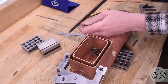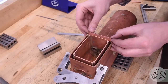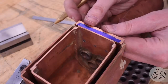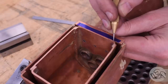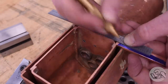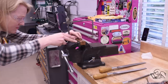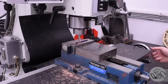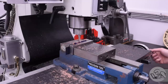I start by filing it to length using as a reference the spacing in the gap — the widest distance the piece will need to fill. Once I've got a really close fit on that, I turn my attention to the profile of the horizontal section, the curved area in particular. I mark the starting and ending points of the curvature, then mark approximately how deep this space will need to be to encompass that curve. I started out doing this with the fret saw and files and immediately got tired of that and went straight to the mill and milled it out. Maybe this is cheating and I'm not a real model engineer, but I got the milling machine, so I'm going to mill things.